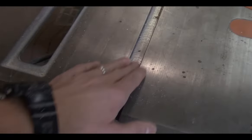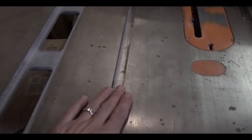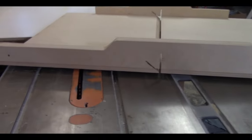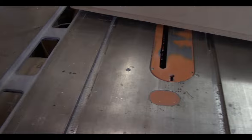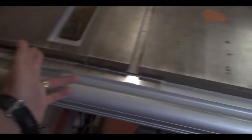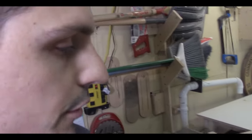Once that was squared, I took some pennies and put them in my track to bring my vinyl strips just proud of the tabletop — just sticking up a hair — and I did it for both sides. I made sure everything was free of dust, then I dabbed some super glue on top of my vinyl tracks on both sides. I put my sled where I wanted it and squared it up to the table edge using a speed square. It's all three-quarter-inch stock so it's nice and chunky, all glued and screwed — except for the front fence, which I didn't glue down in case I need to adjust it.